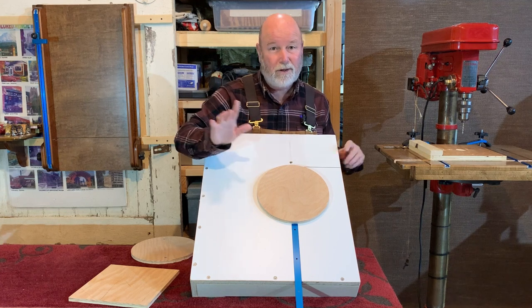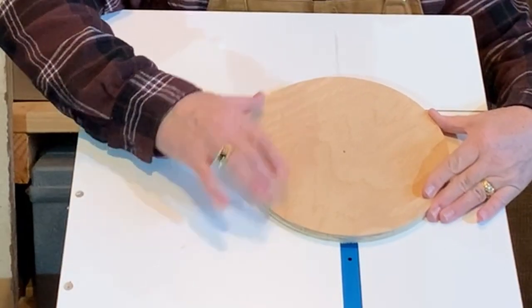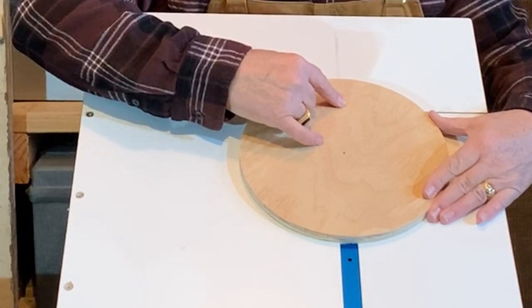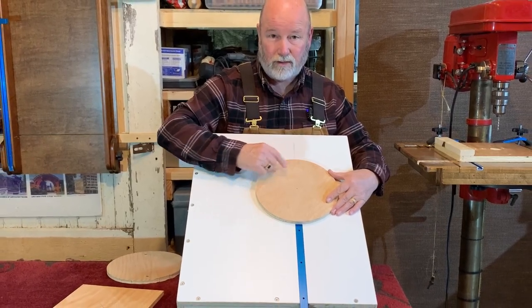And then what's exciting is that I modified my drill press table here to accept the same jig, and then by repositioning it so that the radius is set to the hole for the bat pins, I can then drill one hole, spin it 180 degrees, and then drill the other hole.